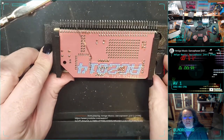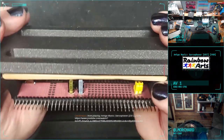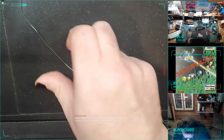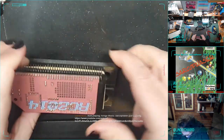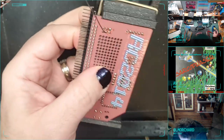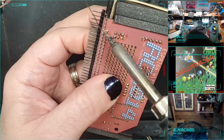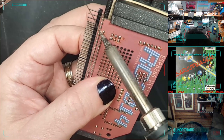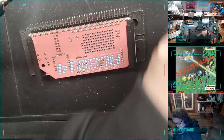I'm just gonna quickly solder all of these. I think we're good enough. There's some give in this whole thing. And then once it's in the back plane, it all kind of self-aligns. And then you can run a bolt or a spacer or a standoff between the boards to kind of force them into alignment. And then once it's there, it's there, and the connections are made, and thinking about making a case for this thing, which ideally it'd be transparent because of all the colors in here.